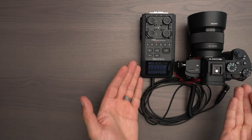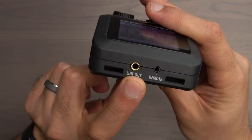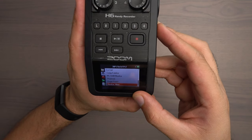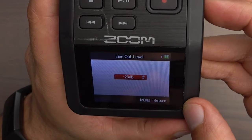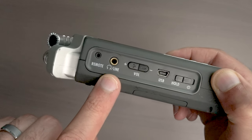At the base of my computer, I have my Zoom H6, and I take that line out extension cord all the way up to my camera sitting on my windowsill facing me. This is specific to the Zoom H6, which has two outputs: the headphone jack and the line out. The line out has a line level output, which I switched to negative 25 dB, so I'm not clipping the gain on my camera. But for most of you, if you're using a different device, you're probably only going to have the option to go out of the headphone amp.